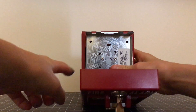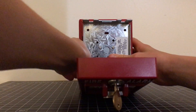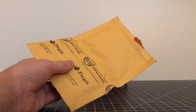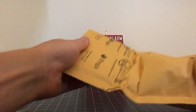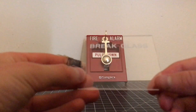Then you're going to want to put in the screws into the pull station right here, or if it's on a flush-mounted back box it'll be the two in the middle. Then before you're all done, take your packet — they give you packets and I have extra packets of break glass pieces. Open it up and you're going to want to be very careful with glass pieces because they're very easy to break if you drop them.